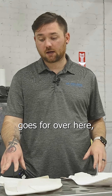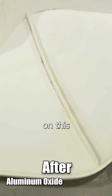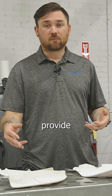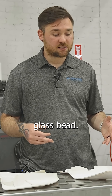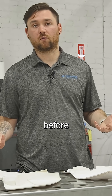The same thing goes for aluminum oxide — it provides more of a matte finish, which is exactly what it did on this part that we blasted in aluminum oxide. It's not going to have that super shine if you blast it in glass bead, but it will get it back to how it was looking before when it was new.